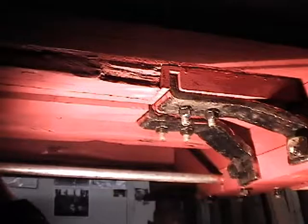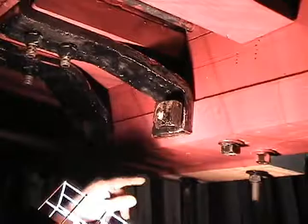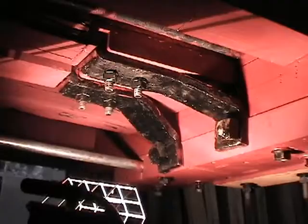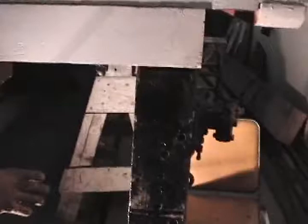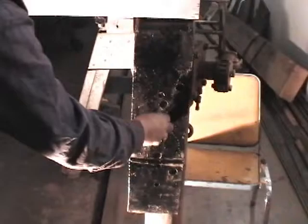We're behind the coupler. The coupler is mounted on the car in two ways: up above is a rod running from one end of the locomotive to the other — inch and a quarter rod with nuts on either end. Down below are two brackets braced up to the bottom of sills four and five — the double sill close together, because this is where you get the most strain on the car. There's also a big square-headed old-fashioned bolt that went through the front with a nut holding the bottom of the coupler. Car 100's pilot — otherwise known as a cow catcher — is fastened on to this brace here.